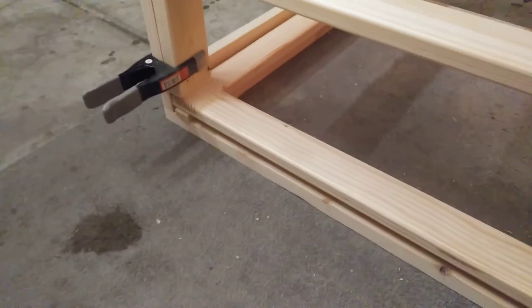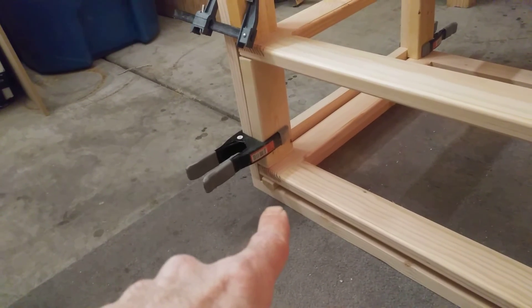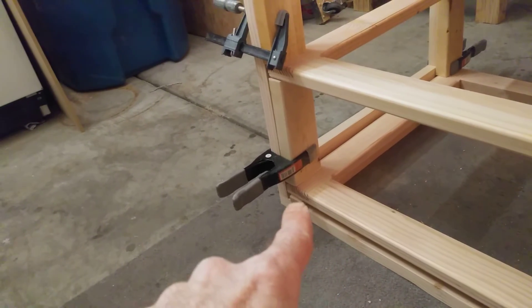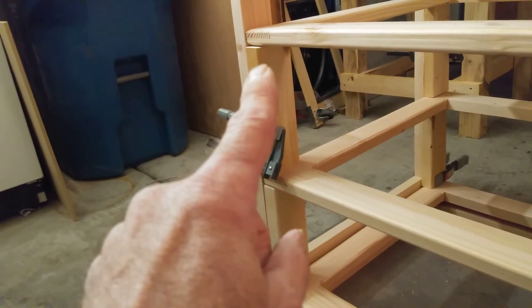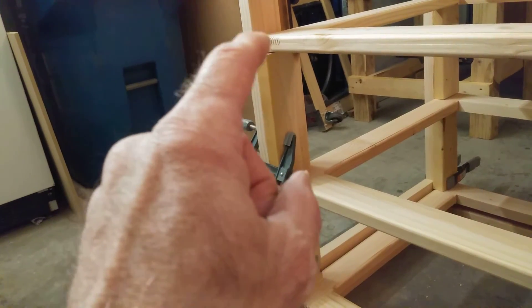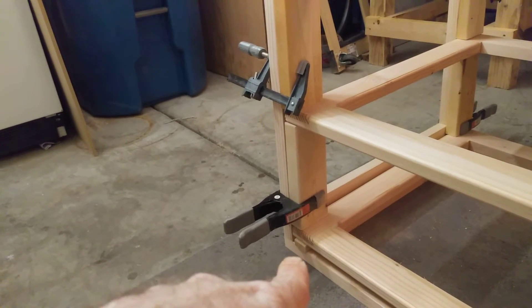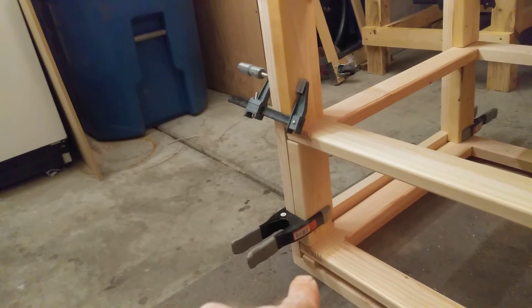You see I've got clamps up here. Down here we're going to have three-quarters of an inch of a gap coming off the bottom. I'm going to make some cleats that are going to go here, here, and here — they're going to ride on both the top and the bottom. They're going to be a quarter of an inch thick and probably about an inch and three-eighths long, kind of like the same size as these that are sitting in there now.